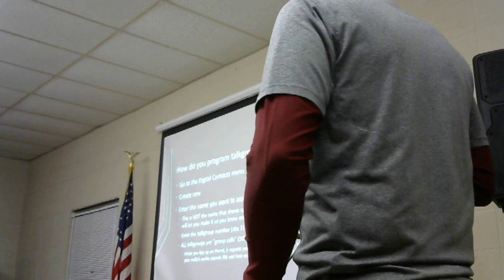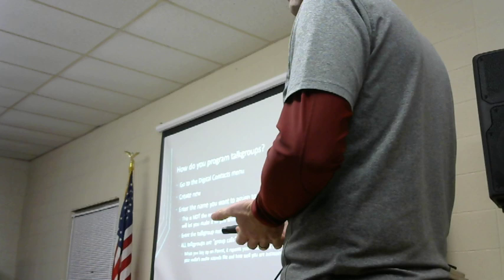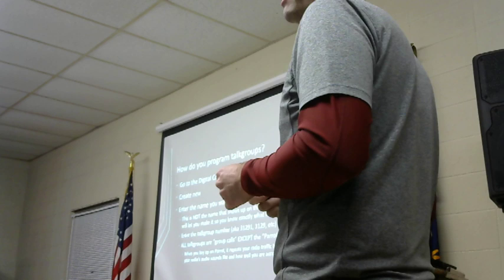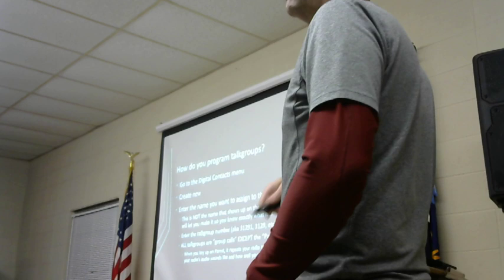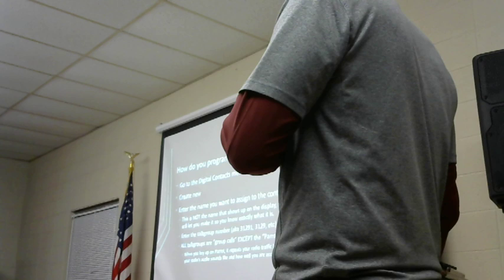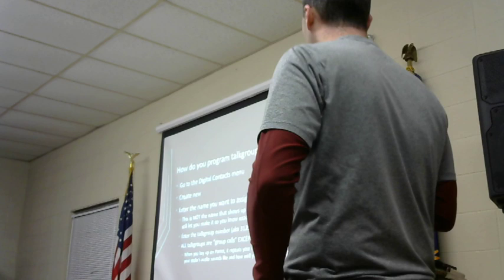So there is a specific order that you want to do this in. If people want this presentation, they can have it later, so you can go back and refer to it. The first thing you're going to do is create your talk groups, your digital contacts. Before you can do anything else, you need to do that. All the talk groups are group calls, and the only private call is the parrot. The parrot is when you key up your radio and say, KB0NHX testing, you unkey and it spits it back to you so you know that you're making the repeater. It's handy if you have a hotspot and want to set your audio levels.